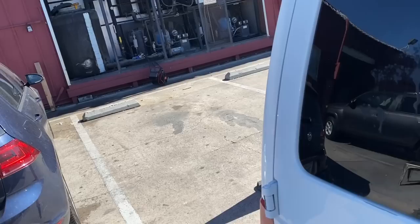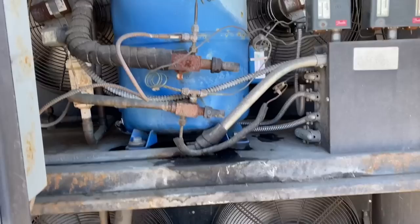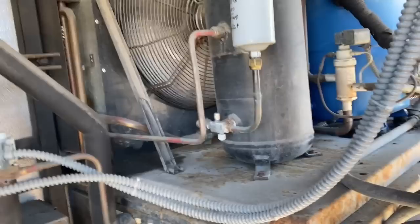The temperature is finally dropping — I think I had iced up the heat exchangers from that pump being cacked up. The controls started to cooperate too. We're at 68 degrees now, we were at 82. I got a ton of heat coming off the fans. My set point is 32. This flare fitting was all oily, so I'm going to get some soap bubbles on it.